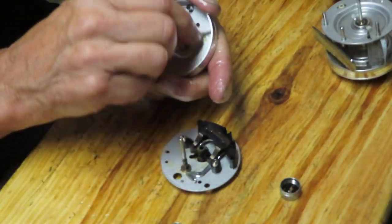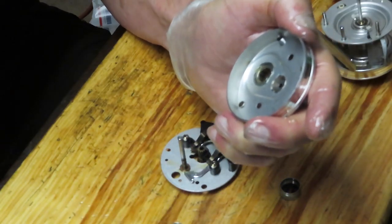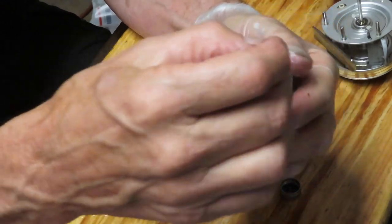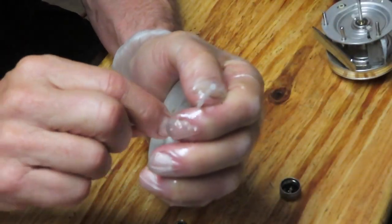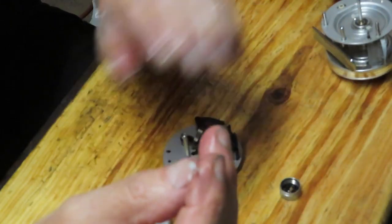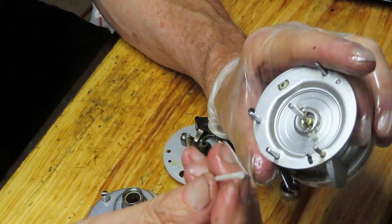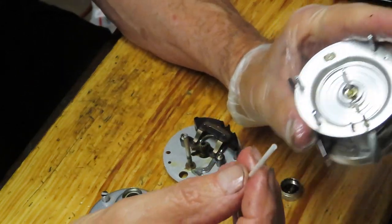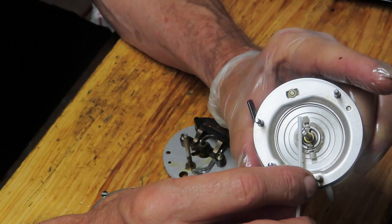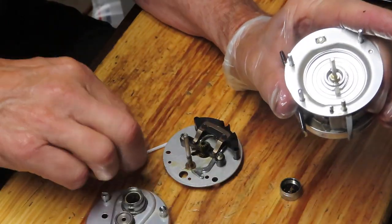There's a little bit of old grease in the side case, so we want to get that out. I'll use a cotton swab and then another one for any residual dirt. Interestingly, the tip fell off the cotton swab — and believe it or not, that little straw from the tip will fit over the brake piece. You can mimic and replace a lost brake to a certain extent just by using a small piece cut off of that straw. Happy circumstance that it fell off to show you that.